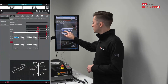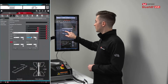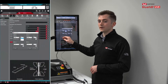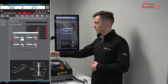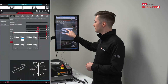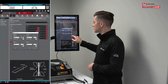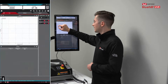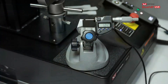I'll keep it as the average. The thickness tab has the same interface, just for thickness instead of width. An important thing to note: you must configure the correct units within this portion of the software, as the software cannot read units directly from the micrometer — they have to be set within this window. With initial width and initial thickness configured, click OK and go back to the Test tab. At this point, the micrometer is set up and ready to go.